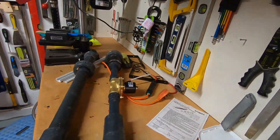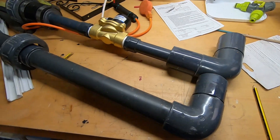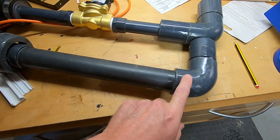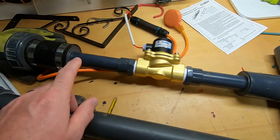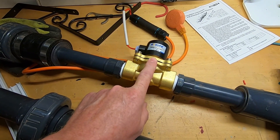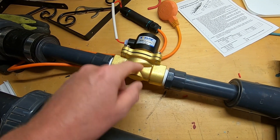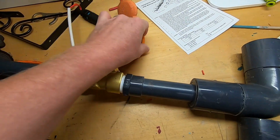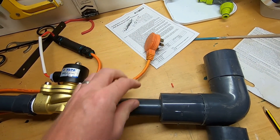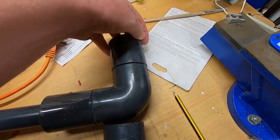So I said I had to make a carbon copy of the waste pipe. This is the waste pipe I've just taken off, with the valve collar on and the elbow. This is a carbon copy — albeit a bit Heath Robinson — with the 240-volt solenoid on an inch pipe with a connector, then an old Flymo piece of cable, and then the elbow cut to the same distance. I'll just give that a bit of a trim.